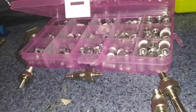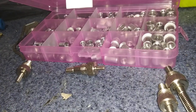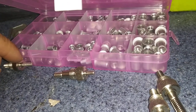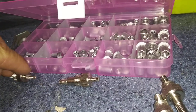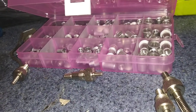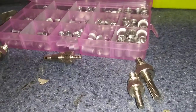That will allow me to fix a lot of issues without having to re-thread holes to a different size and modify whatever cover I'm using. Say I was installing a cover and needed to keep 6-32, otherwise I'd have to drill the cover a different size — it'd be easier to just drill and re-tap the holes and have everything original and not look out of place. And that's about it for this tool.